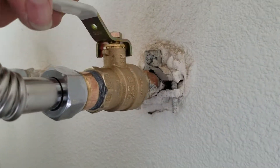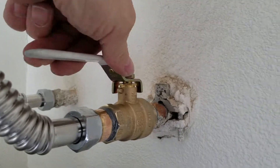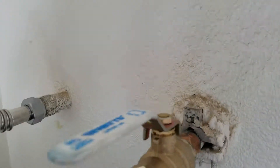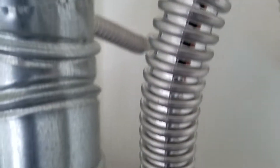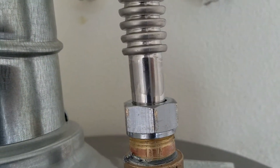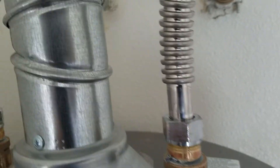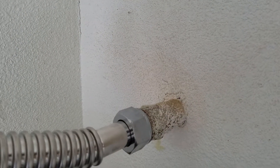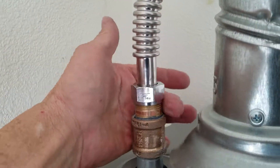Up here at the top we have a quarter-turn ball valve — quarter turn off, quarter turn on. That's a Watts ball valve, top of the line, brass. Then a brass nipple and a Falcon stainless steel connector — it's three-quarter by 15, with a full 0.725-inch inside diameter, which is the biggest in the industry. We like these supply lines. Same thing on the other side; there's already a copper male adapter in place, so we just screwed another connector on there down to the tank — that's a 15 as well.